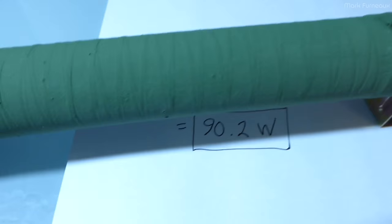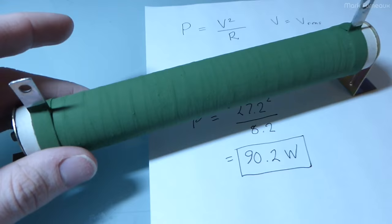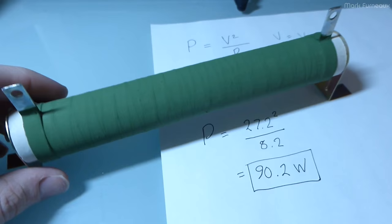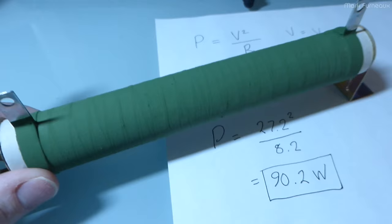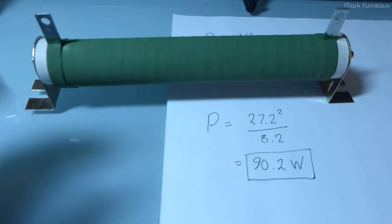Using these power resistors as dummy loads is really a good way to do stress testing and burn-in. Of course these can be used for a whole bunch of stuff that's not amplifier related — it's always good to have a big dummy load around. These are nearly indestructible. I chose 100-watt resistors because most of my amplifiers are around 100 watts, though these can handle overloads for a while, so there's no real issue. Anyway, hopefully this was interesting and you got something useful out of it — thanks for watching.